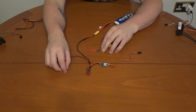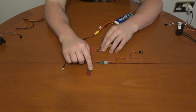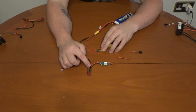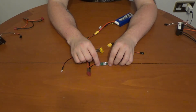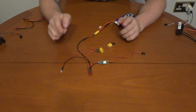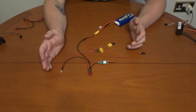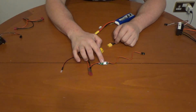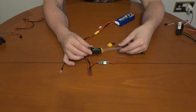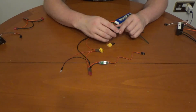You'll also see that the black wire of the LED goes in here where the main black wire was. So already we have two wires here. The third one, and the second red wire, is from the BEC — the battery eliminator circuit. This little circuit's job is to make sure there is a small amount of power going from the battery to the receiver. With 11 volts coming through the entire circuit going straight to the receiver, there's a chance you can blow the receiver — we don't want that. This will convert it down to 5 volts, a safe voltage. The receiver I have is an FSIA6B, a Flysky receiver — it can take 4 to 8.4 volts DC. 5 volts is plenty for this.